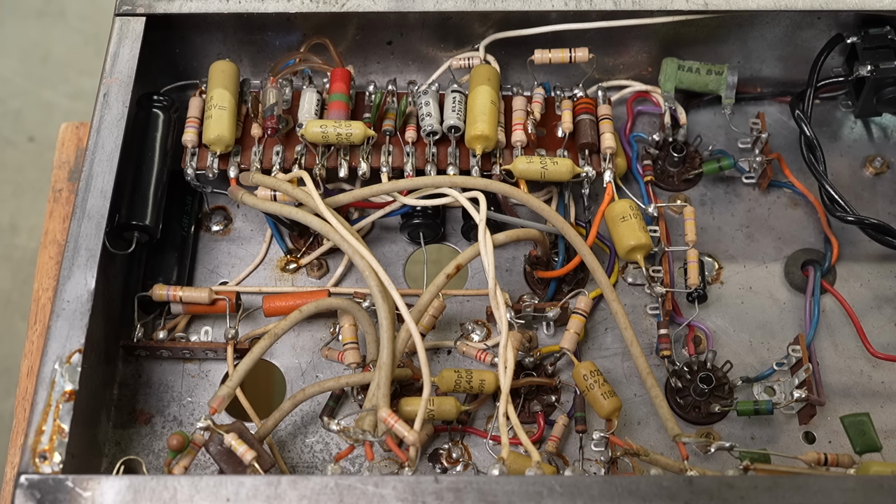You've got to fully clean the solder joints off and unwrap the lead before you can remove the part, which is a bit tricky. Often a lot of techs will just cut the lead off and then dab onto the existing blob of solder, which gets bigger every time you change your part out because there's another old leg in there. But I try to do things the right way. I know it's one of my faults, but I guess that's why people come back. Not with their amps broken again either.